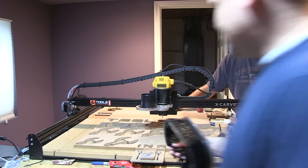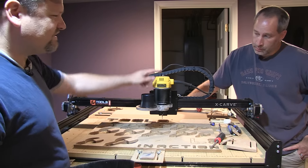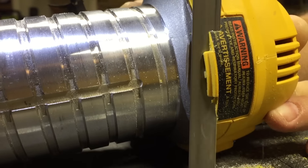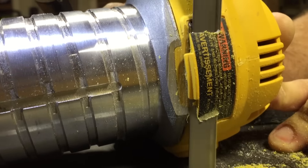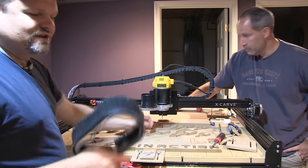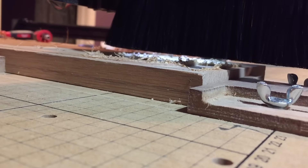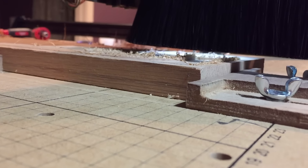So I was like, this is not working. All I had to do was adjust it. I had to lower my router down. I shaved off the side, which you're supposed to do with this mount. Push it down, push this all the way up, and just make sure that my cutting bit is right at this height. So generally now I do not have a problem with it, and it's running smooth.